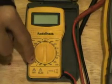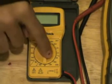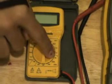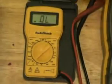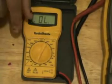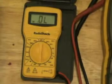It has a diode check, which could also be used for continuity check — always useful. It does ohms from 200 ohms, 2 kilo-ohms, 20 kilo-ohms, 200 kilo-ohms, and 2 mega-ohms. This is not an auto-ranging multimeter, meaning you have to physically move the dial to its maximum range. So if we wanted to test a 5 kilo-ohm resistor, you can't put it to the 2 kilo-ohm setting, because 2 kilo is the highest setting it can measure — so we'd put it on the 20K.